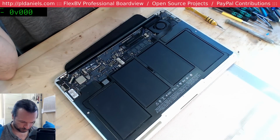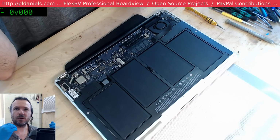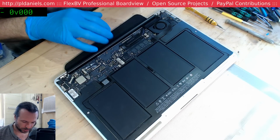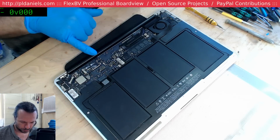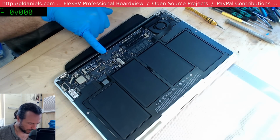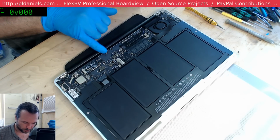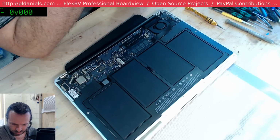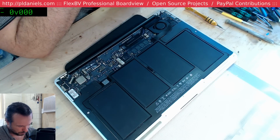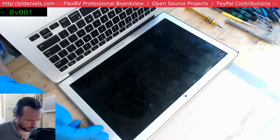Alright. First glance, this looks clean. It's a 00165 board. You can very quickly tell that it's a 00165 versus a 3437 if you look at the programming connector. The 165 has a very short connector, whereas the 3437 has one about twice that width. Let's see. Looks pretty clean there. It looks pretty dirty there.